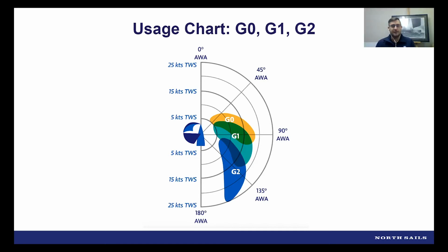Yeah, we've got a great east coast of Australia, going from Tasmania down the bottom, where we have very low humidity, quite often high winds, and ocean crossings to get across Bass Strait. And then as we come up the coast, the humidity and temperature rise, we have generally lighter airs, and boats are sailing the whole east coast and quite often venturing up into Asia. So we have a whole range of conditions that we may be taking into account when advising on the sail options and the fabrics. And humidity is one that we've all talked about in the past that comes into it, particularly up into Asia.